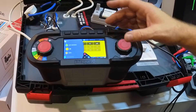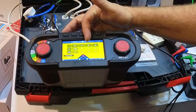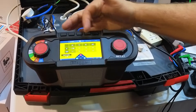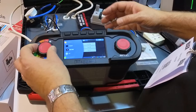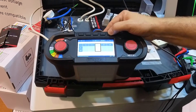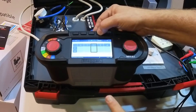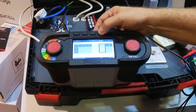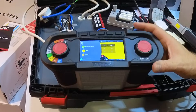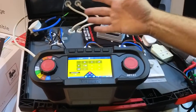The RCD comes with this configurator box. For Europe, we've also got the ability to do a two-times test in there — it's set up for UK by default but you can enable it. Going into the configurator settings, I can select two and it's enabled, or disable the five as well. Coming back to the RCD screen, you can see I've taken them both out, so that is my test sequence — that's all I'm going to be doing.